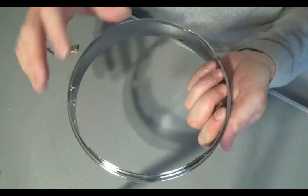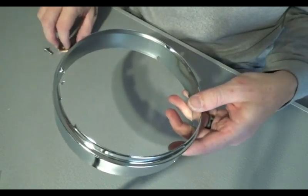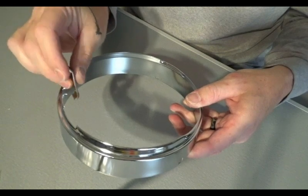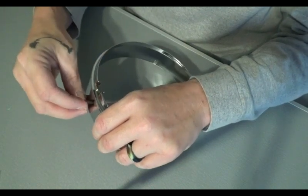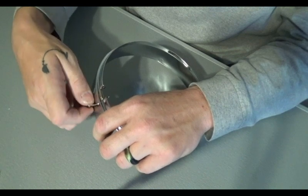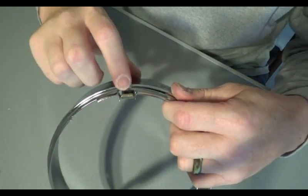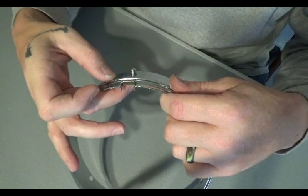The next step in pre-assembly is the inner ring. Going around the edge of the inner ring, you'll find a recessed area — that's the top, and that's where the retaining hardware goes. Place the retaining hardware in that recessed area with the beveled edge going up. Put it inside there, take the screw and thread it in — don't tighten it all the way. Let it hang below that lip so the outer ring can slide over it, then tighten it down to hold everything in place.